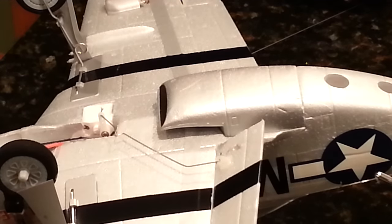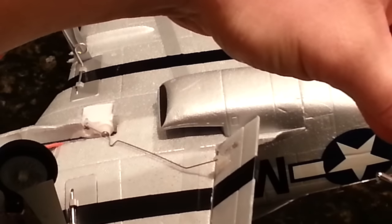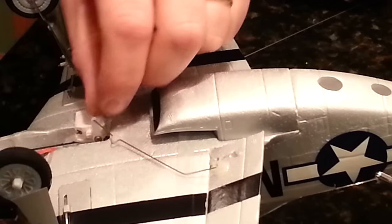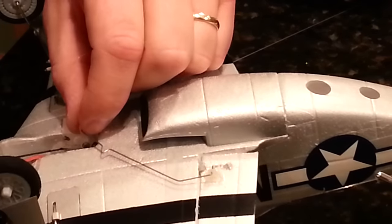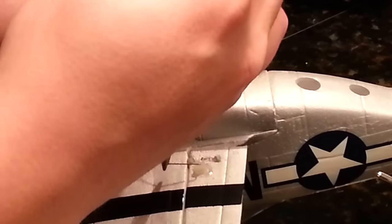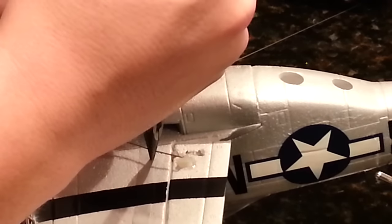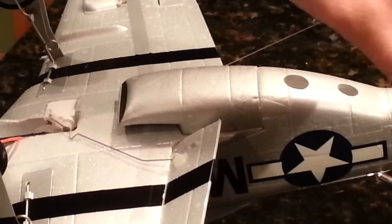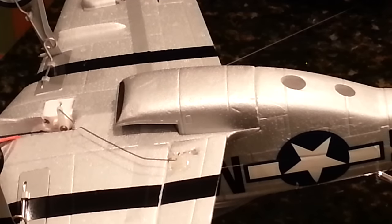There's takeoff flaps and landing flaps, but I can already see the first problem — I don't have enough stiffness to push this thing back. I can deploy the flaps but I can't retract them. Part of that comes from not having it tight — there's so much play in this hole. I think we're going to be able to do it but we'll probably just have to straighten this thing out. That's why you guess and check a little bit on this stuff. There's your flap deployment but still not full retraction, so I'll go ahead and get that straightened out.